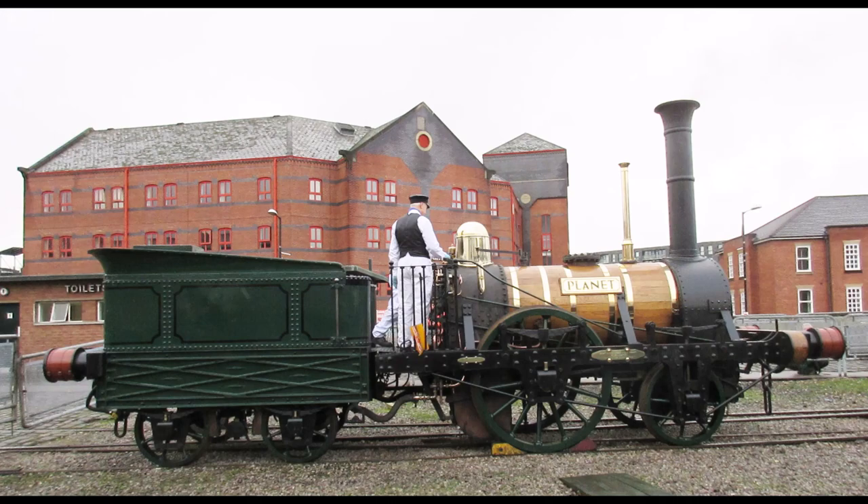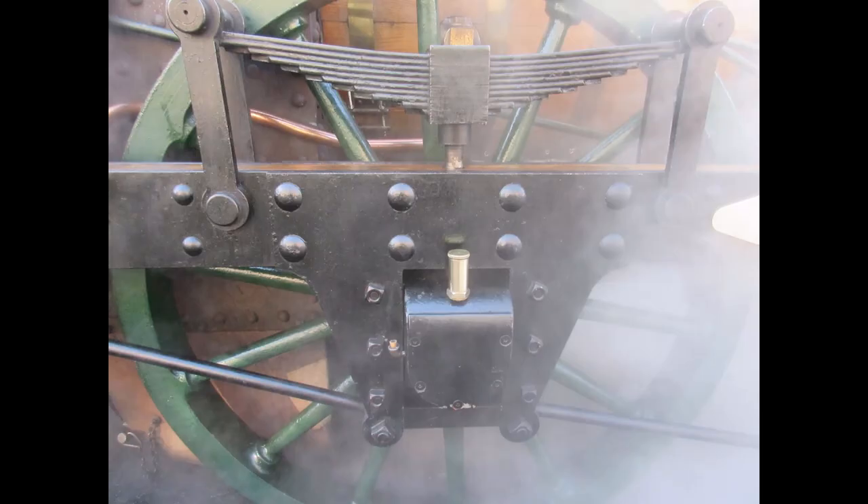Even more dramatic were wheel and axle failures. The first sets of wheels were wooden, with wooden spokes and rims with an iron hub, but they were too weak to take the strain, so they were replaced with wrought iron wheels, but they too were poorly designed. Robert Stevenson was working at the cutting edge, if not beyond the cutting edge of materials technology.